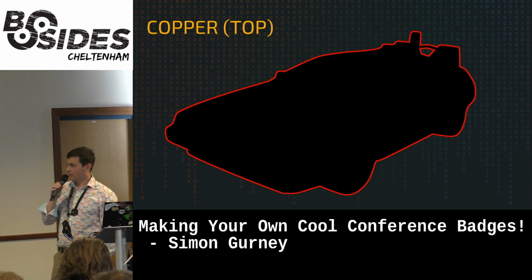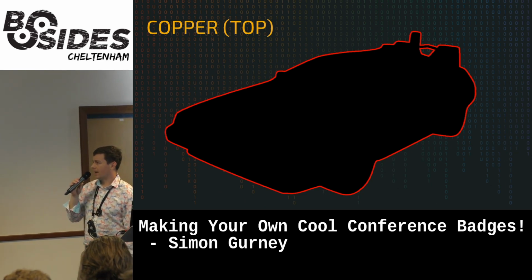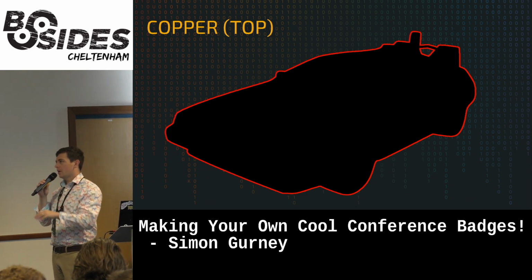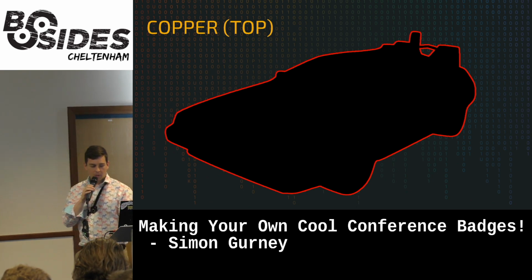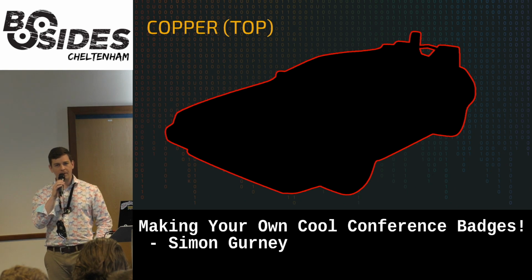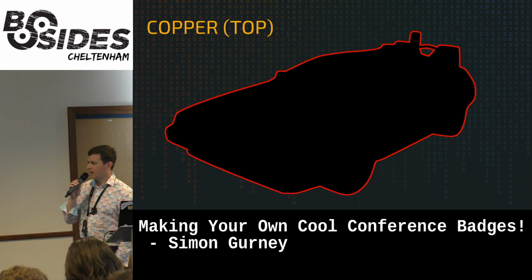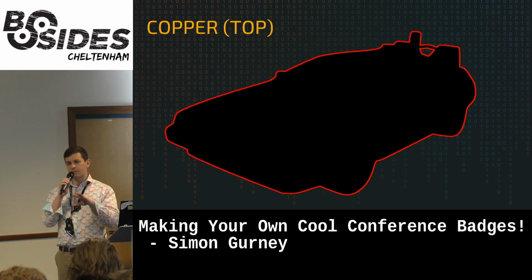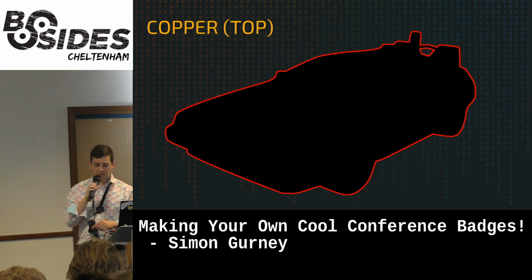So we end up with basically the copper layer. In this case, you can either say where you want copper, or you can say where you want copper but then where you want exclusions. You can't do this on most layers, but on copper you can, and it's really convenient. When you're doing circuits, quite often they have big ground planes, but you might say I don't want the ground plane here, or you want the ground plane over everything apart from where the components are, and it will work out the magic for you. So we can use that to our advantage.